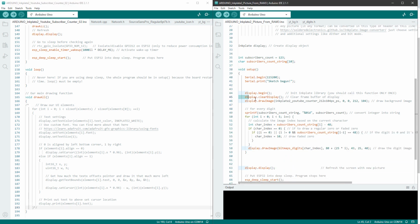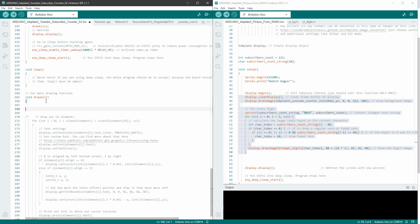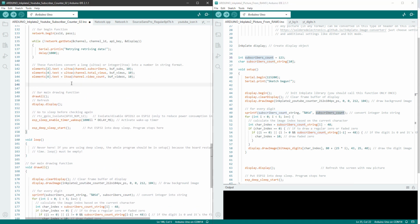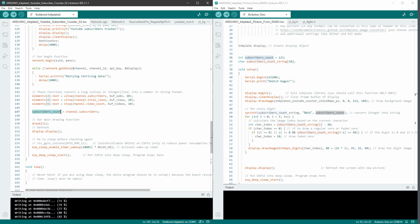We want to start with clearing the display, drawing the background and drawing every single digit, so just paste it in here. But we haven't set the subscribers count variable, so we have to set it inside this code up here. So when we are getting the data, I want to set the subscribers count to be the channel.subscribers. However, the channel subscribers is type of long, and our subscribers count is type of integer, which might not be big enough to hold all the numbers.